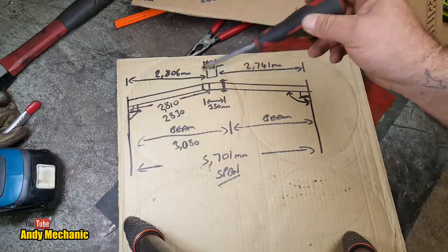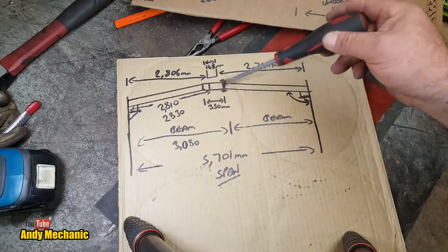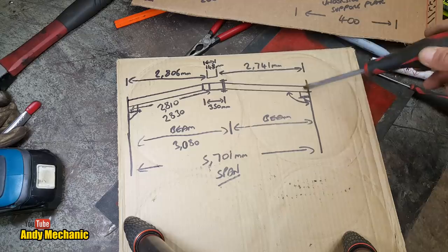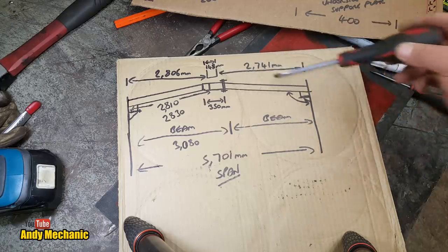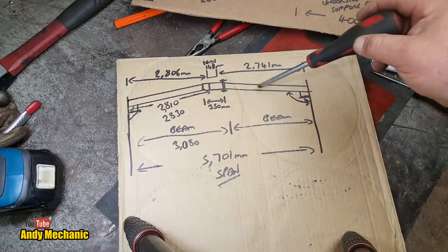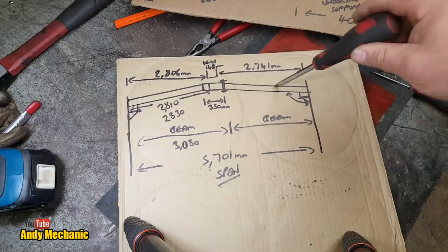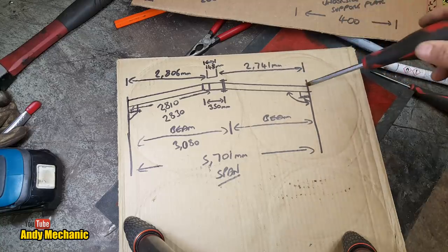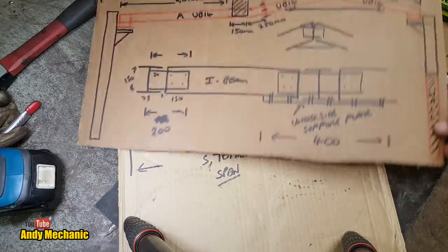So we've got the lean-to angle, a horizontal section in the middle, and then the same angle coming back down. Originally there was the apex here, and it is going to reduce the height in the right-hand workshop — the original workshop. But this is a much stronger configuration. Going back to the original design, the force is coming down and it's going to push down on that joint, creating an awful lot of stress on those lower bolts. On the new design, as the load is pushed down, that joint is actually forced together — just like the old-school archways with a keystone at the top, where the force goes down and actually forces all those stones together.